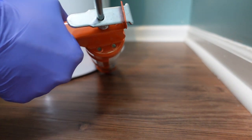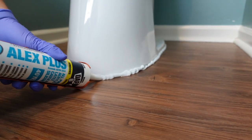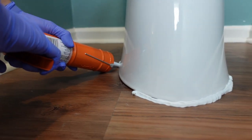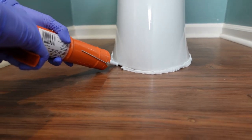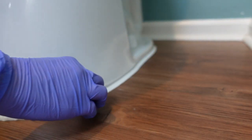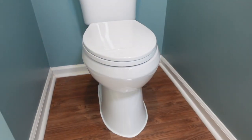Lastly, we also used a caulk gun, because there's always caulking projects to do around the house. During this project we learned it's really important to caulk around the toilet: first, to keep dirt and mess from getting under it, and second, to help the toilet stay secure in place. We also learned it's a good idea to leave the back section uncaulked, so that if there's a leak under the toilet you'll eventually see it coming out the back. We got a nice smooth edge using a silicone sealing edge tool.